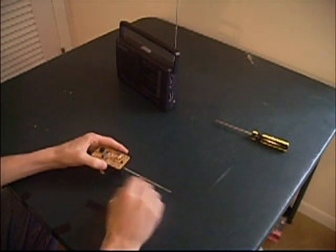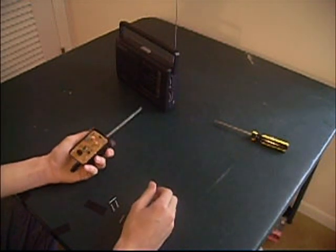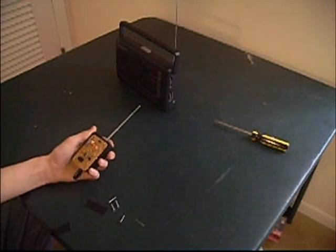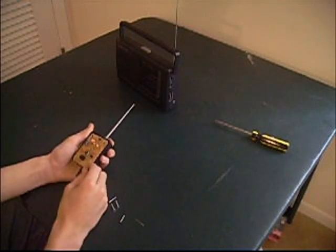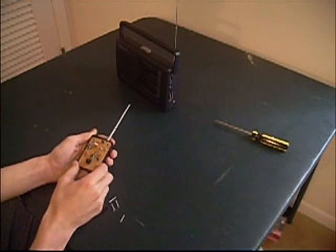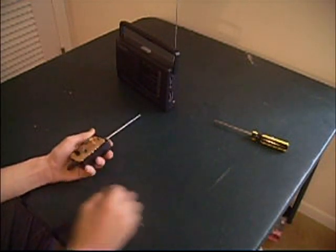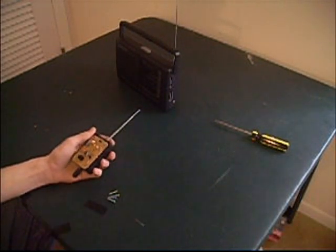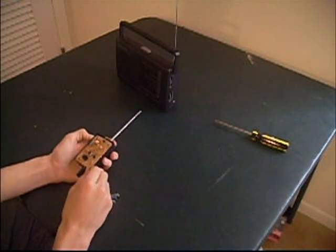in putting in the wrong capacitor value, I actually am transmitting over the TV band. I did check on the FCC's website and they say it is totally legal as far as transmitting over the TV band, as long as it's an analog signal and as long as you're not interfering with any existing transmission. It's more or less a lighter and fairer restriction than that on the FM band.